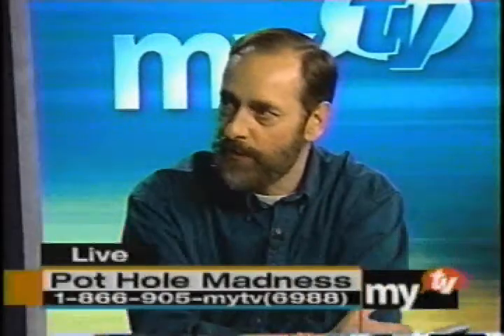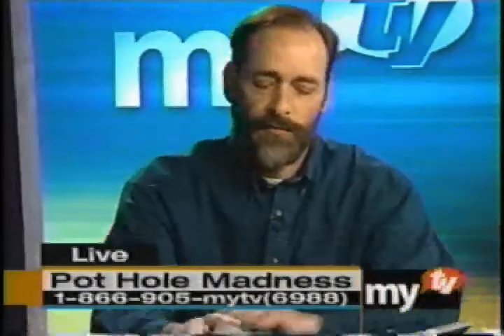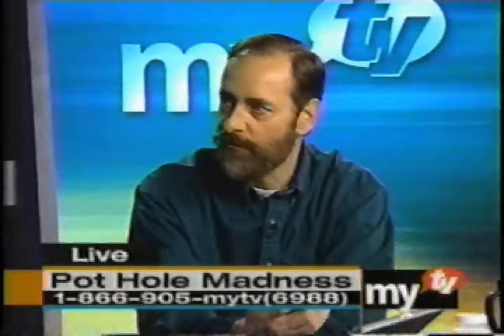It almost became an accident, you told me, about how well it works with asphalt. Yeah, one of my associates didn't think it would stick to asphalt, because almost nothing sticks to asphalt. New asphalt doesn't stick well to old asphalt — they put all types of emulsions and petroleum products, they paint the asphalt when putting new asphalt over old. So just on a whim, we made up a tub of Dirt Glue and dumped it on a parking lot and tamped it down. Later we went back with a diamond saw, cut some pieces out, and tried to break them apart — we couldn't. We brought them to asphalt companies, and they tried with vise grips and channel locks, but all they'd do is mash the asphalt. They'd never break the bond. So we started experimenting with just plain asphalt, basically a waste product.